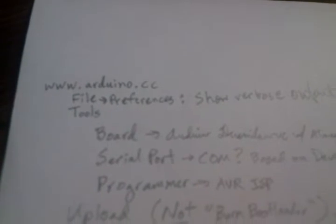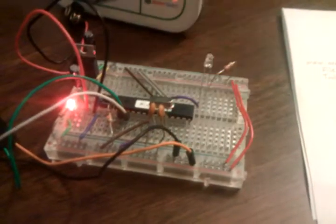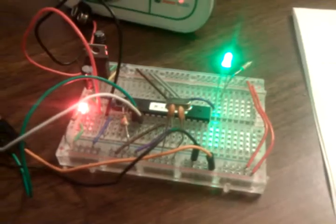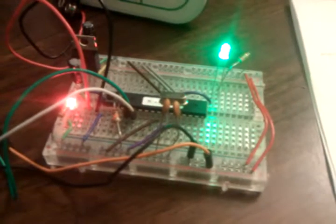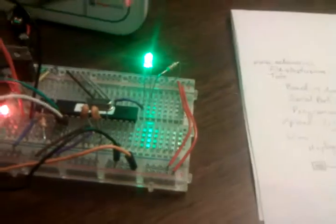One of the confusing things was that they have two boards. You'll get into documentation that will say, oh, you need two Arduinos in order to program one of them. I'm like, what? But no, that's just for the bootloader. In order to load the bootloader, you have to connect up different pins than you normally do. When you just upload your compiled script, you'll just use the RX and TX pins and the ground pin. That's all you really need. But they were saying you need these other things, and I just got this, so I just wanted to use this.